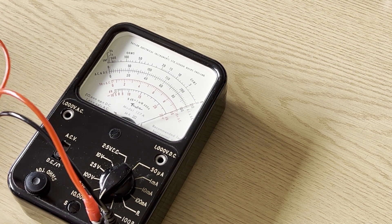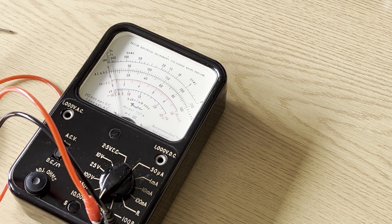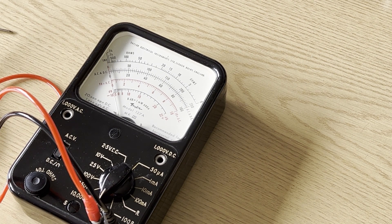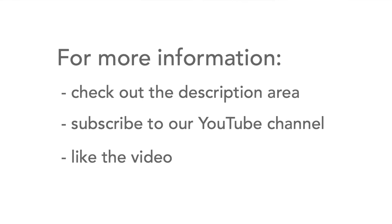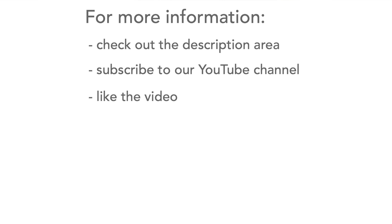That makes me really happy that this meter is now fully operational again. Really good news — it just shows what you can do. You can get batteries for these old meters and even if you thought some while ago that you might not be able to source them, they're out there. Just look around on the internet and you can find them. I was particularly pleased with the 15 volt B121 battery that had the little 1.5 volt button cells, because they won't leak and I'll also be able to replace those as and when, and I'll still have the holder. If you need any more information about meters and other things, head over to the description area, and please don't forget to watch more of our videos, like this video and subscribe to our channel. Thank you very much.